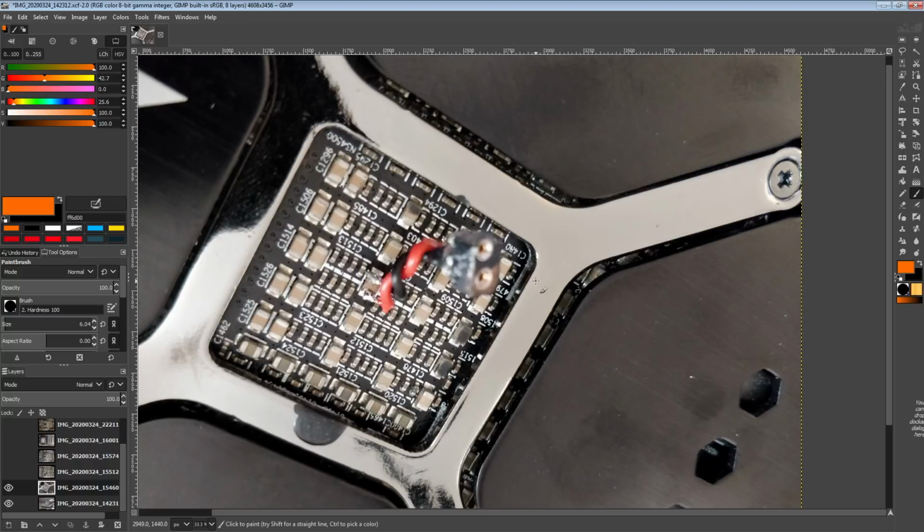I absolutely hate it, because every time I feel like I've figured out some nice, easy, convenient way of doing things, I find out that actually, no, I haven't. The probe gets nudged and suddenly the measurement is off, or you notice that it's measuring less noise than before, and oh no, it's not hooked up properly. Then the scope and the system are on the same ground, both connected to earth mains and on the same power strip, but there's still a voltage difference between them. It's not very big, but it's enough that, without a workaround that I came up with, it skews voltage measurements upwards.